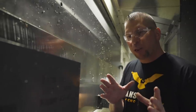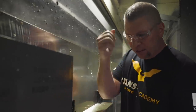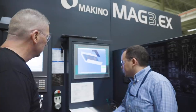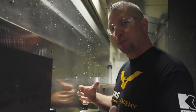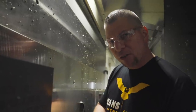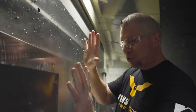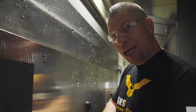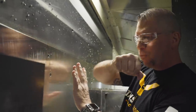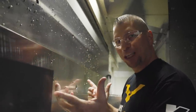When most people think aluminum machines, you're thinking three axes — table down here, Z coming down, X and Y. But what they've done is looked at the structural pieces they're making and thought about how much material they need to remove very quickly and where the chips go. They reinvented it — instead of three axis, they flipped it up and made it a horizontal, so chips drop down. As the spindle comes in, it can flip around, do both sides, underneath, over, and machine the entire thing as a five-axis complete.